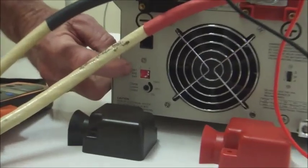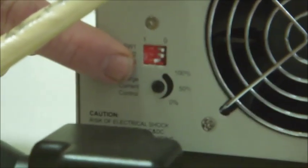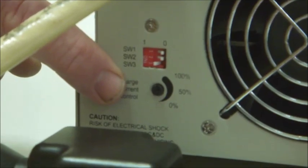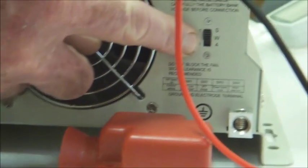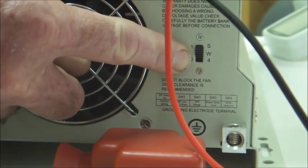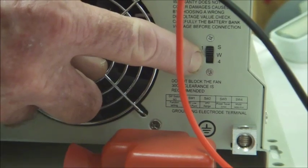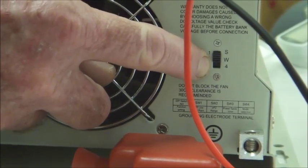The first switch is the DC setting. S1 is the low voltage cut-out switch. S2 is the AC input voltage range. S3 is the load sensing switch. S4, if required, is the remote battery charging which will automatically switch the charger on after 15 days of voltage stabilisation.